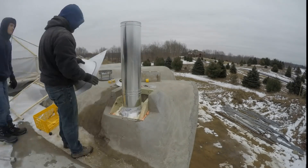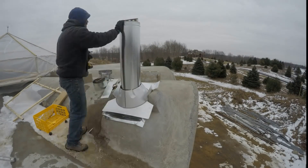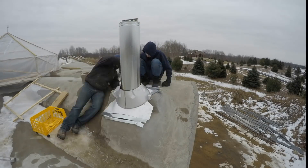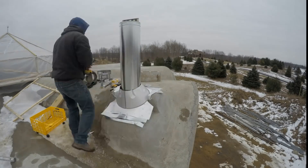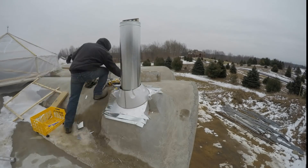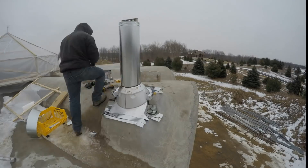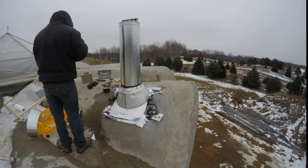Next comes the actual flashing that keeps the rain out. Because I'm building in super slow mode, I don't expect to properly finish the chimney this year, so this is just temporary flashing — I'll probably just leave it in there. I don't want to disturb my nice ledges because I plan to add stone later, so I cut it to make it fit and then do what I can to make it watertight. It doesn't look pretty and it doesn't need to — it just needs to shed most of the water for a year or so. I got a bit crazy with the scraps of flashing just trying to cover the holes, but that Henry's roof sealant stuff is so good that it probably made up for my janky job. It's been more than a year now and we've had no leaks, so job done well enough.